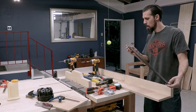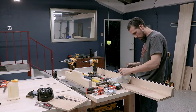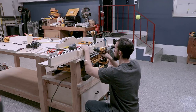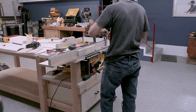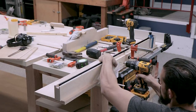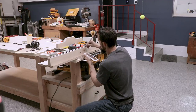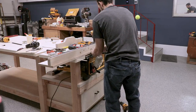Everything is offset slightly so the fence comes off the surface of the sled bottom a little bit, and the track is also offset so they kind of interlock with each other, making it easier for the pieces to sit together. For the final connection I put a scrap piece of wood flush on the bottom and against the fences, then screwed holes through them to mark the next step. Since I want this to be a removable and adjustable piece, I put epoxy in those holes and used threaded inserts so I can easily screw the connector piece on and off as needed.